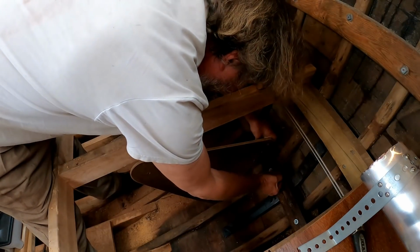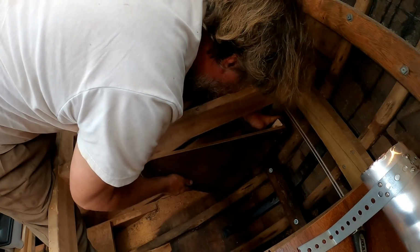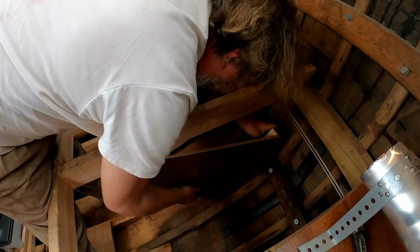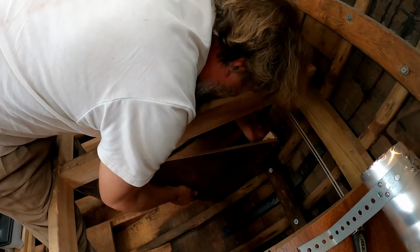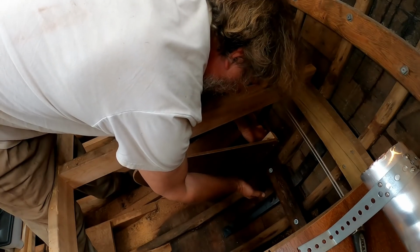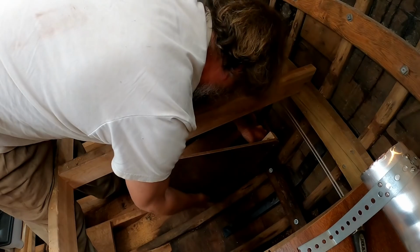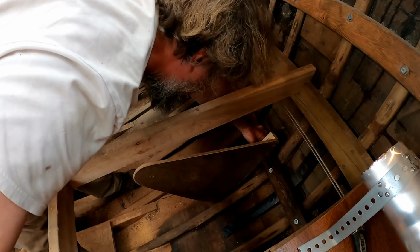So because I have to start with the frame flat on this stringer, I just slide it flat down this stringer, boom, boom, boom, boom, until the curved part meets the inside of the hull. And I know that my center line is in exactly the right place. In other words, it's going to swing from just touching the hull to something that is in a plane aligned with the face of that. Anyway, that's in principle. Let's see if it actually works that way.